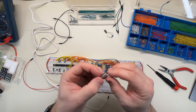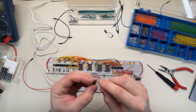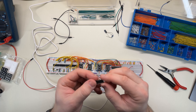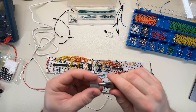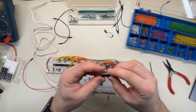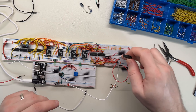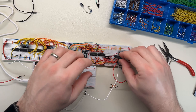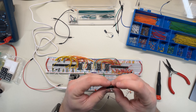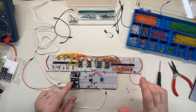I was going to put this in — this is the chip that was originally on this side — and I noticed that one of its pins is bent. I don't know if I just did this. What if that was not connected properly? Let me straighten it out. That was the D input — no wait, that's ground. I don't think the chip would have worked at all if that was not connected properly. This is the one that used to be on the right, so I'll put it on the left, and here's the chip that used to be on the left — I'll put it on the right. I've swapped the chips now.